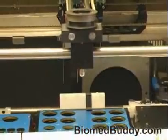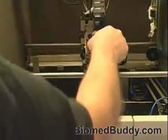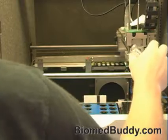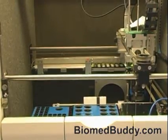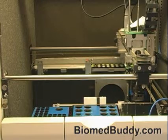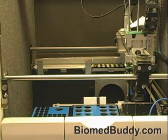Next I have to check that the needles aren't restricted or defective. I'm going to take a little vial and put it over my waste bin here and put in another 20 pulses. By the way, you do not want to pulse these one after another too many times. Take a little break between them, especially if you're putting in something like 50 pulses, which you would do if you were putting in bleach or clearing bleach out.